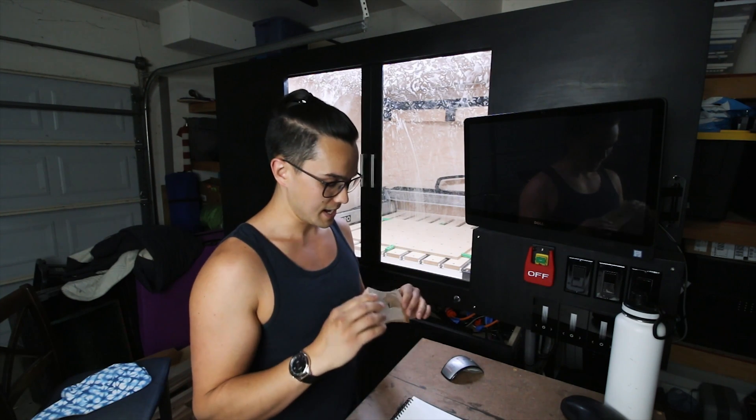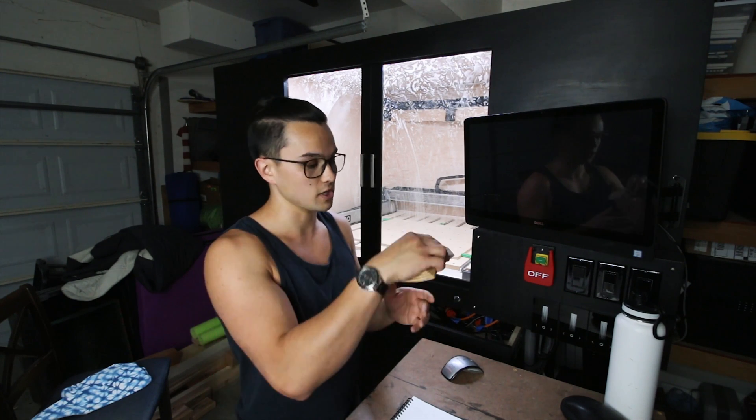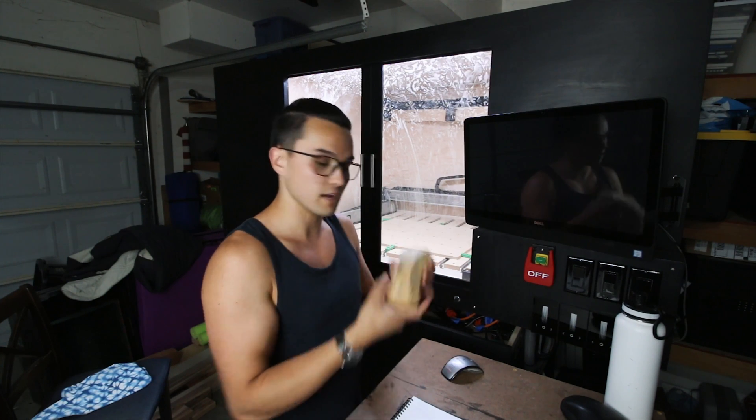Today's gonna be fun. On the last episode I made my very first climbing hold and it is full of defects. As much as I'd love to buff those defects out, I think I'll just clear coat it, park it on the desk, and treat it as the first thing I ever made. I want to do an improvement upon my first go - I'm upgrading from quarter inch tooling to three-eighths tooling. I got a very nice tool from Lakeshore Carbide, and I'm hoping that bazooka-status tooling will mitigate the rigidity issues I've been dealing with.